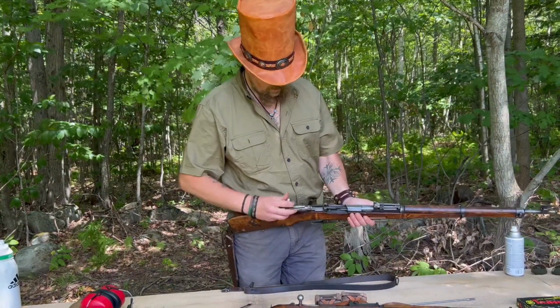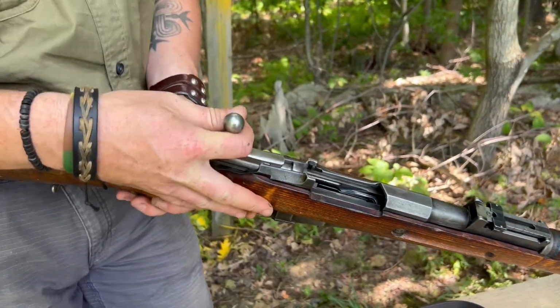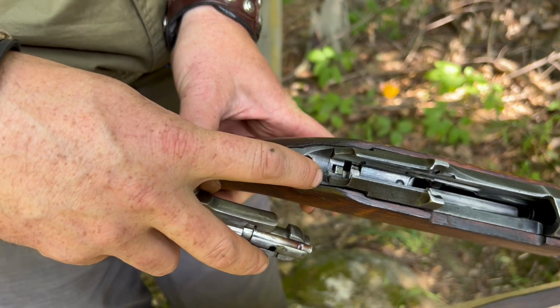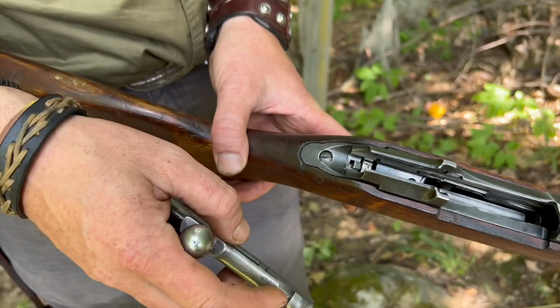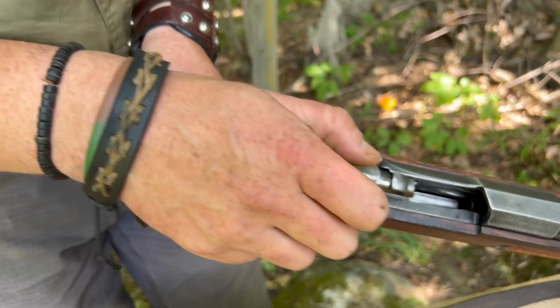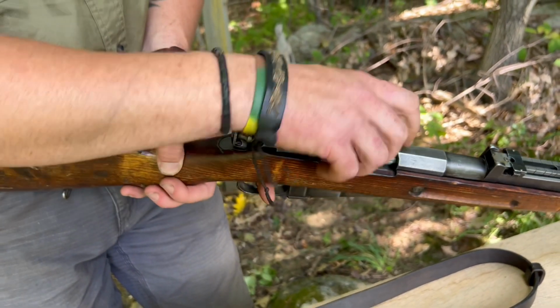Slide the bolt back in through here. You gotta pull the trigger back. Notice that the trigger has an interlock right here when you bring it down. And there's that two-stage action. See, there's right before the shot, and squeeze it, and then you release the sear. So, nice two-stage trigger. So I'm gonna slide it in beyond that. Get it in there, make sure she's going good.